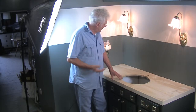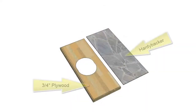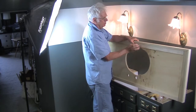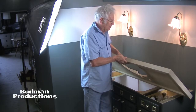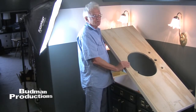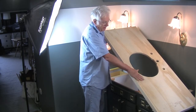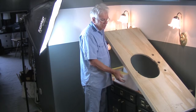This is the countertop laid in place in the space before I applied my marble top to it. The countertop is built from three-quarter inch plywood. I've reinforced this around the edges with poplar and it has a poplar front facing on it. Since I used poplar I also used Gorilla Glue on my seam here to help hold that poplar in place. I was afraid that if I didn't do that, since poplar has a different expansion rate than what my plywood has, I might eventually end up with some cracking because of expansion and contraction.